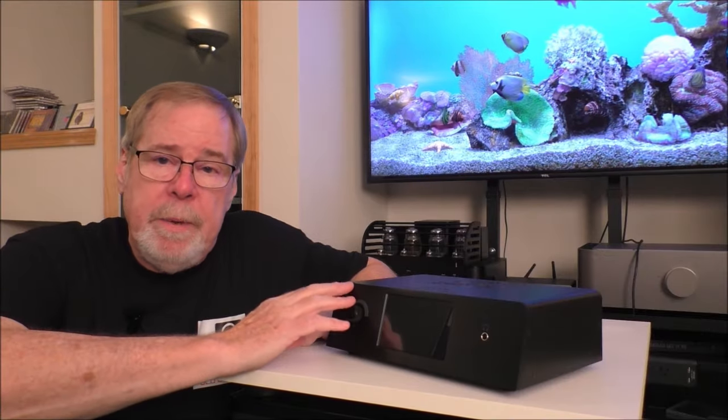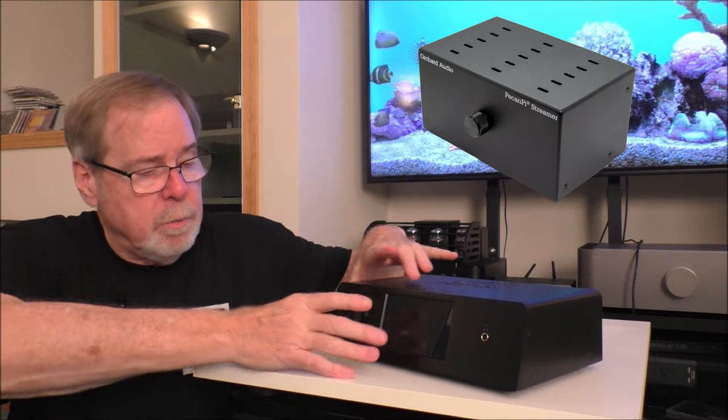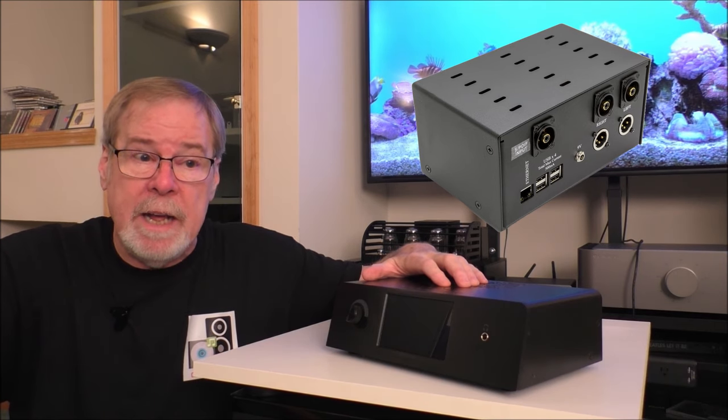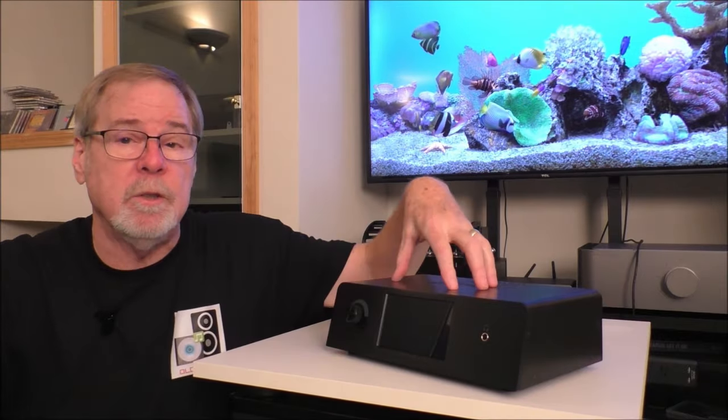So I'm going to talk about the Orchard Audio. This is the Pecan Pie Premier Plus Streamer, and I did a review of this in my Streamer Shootout video. I'm using it as a surrogate for the DAC-only portion, which Orchard Audio does sell — it's just got a volume control, no display, a smaller box, but uses the exact same board inside for the DAC. It's a balanced DAC with SPDIF input. Single-ended, headphone jack, and USB to SPDIF converter are all options. I used it with SPDIF and a DDC that converted USB to SPDIF, running it just as the DAC-only. The curious thing is the DAC is on all the time when plugged in — the power button on the back just wakes up the Pecan Pie.